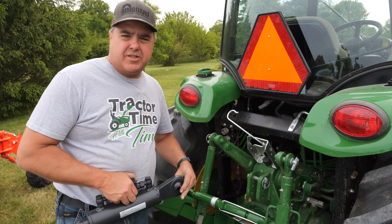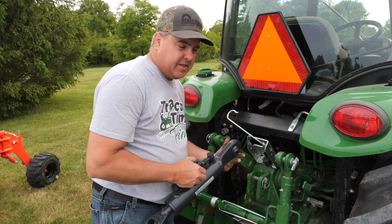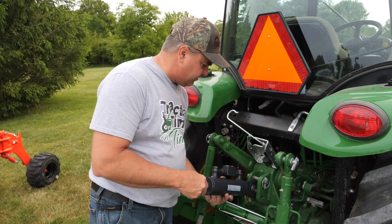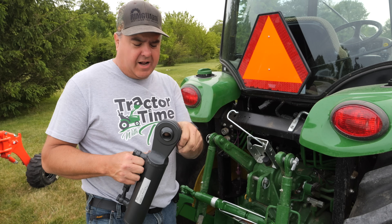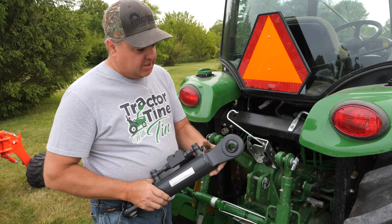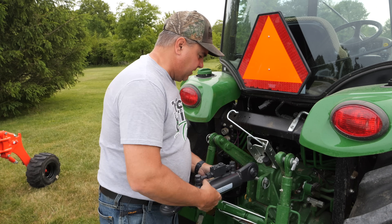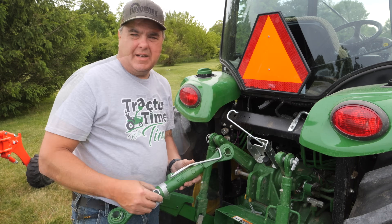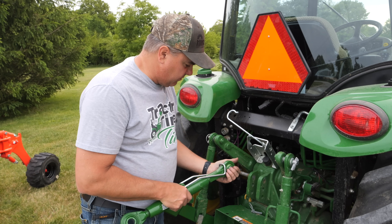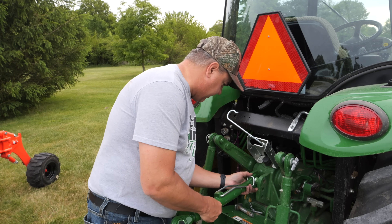I was going to use the hydraulic top link instead of the standard one, but it's a little too wide here. It's easily resolved by grinding a little bit of the edge off, but since I've got the factory one here, I'm not going to take that effort. The hydraulic top link is still a better answer — just a little grinding of the lip on one side would allow it to fit. Even so, we'll still need a bushing in this top link because this pin is Category 1. I had to cut a little off my bushing to make it fit.